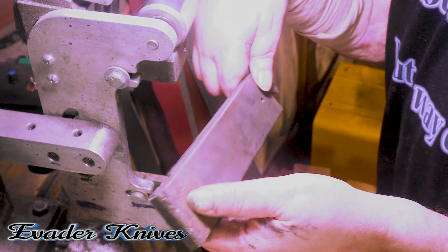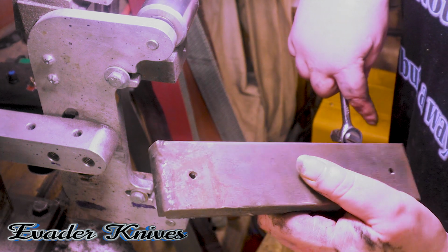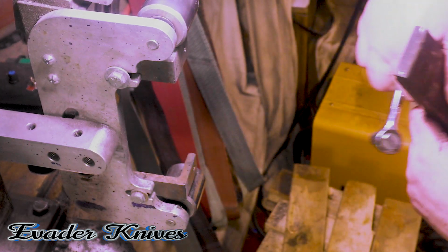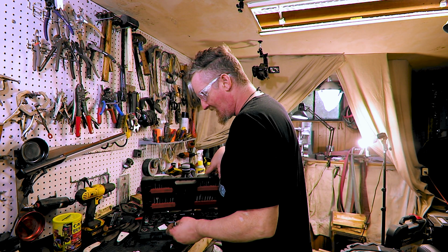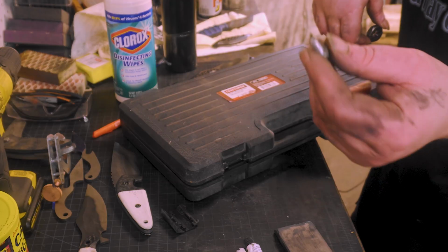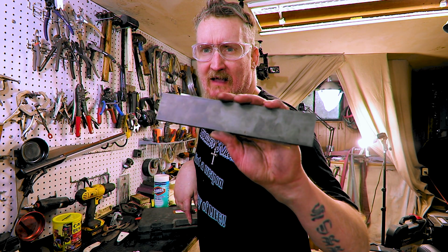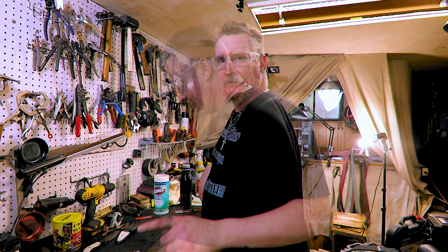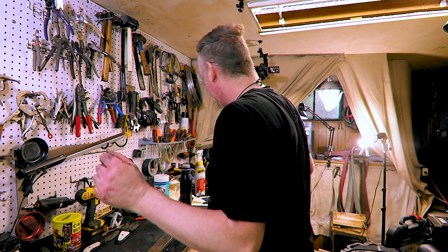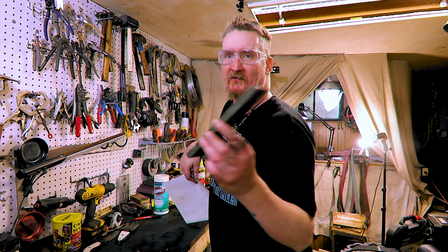First thing we've got to do is get these layouts. We've got to get where these holes are laid out. So let's go back to the bench and I'll show you what we're doing. I broke out my dies to check it, and I was wrong. It's not 5/16, it's 1/4 inch. I have a whole bunch of 1/4 inch, but we still don't want to lose these. What we're going to do is lay this out and drill and tap it. A little trick I learned from watching AVE. In the shop we have dirty fingers, especially when you're pulling off old rusty stuff off your belt grinder.